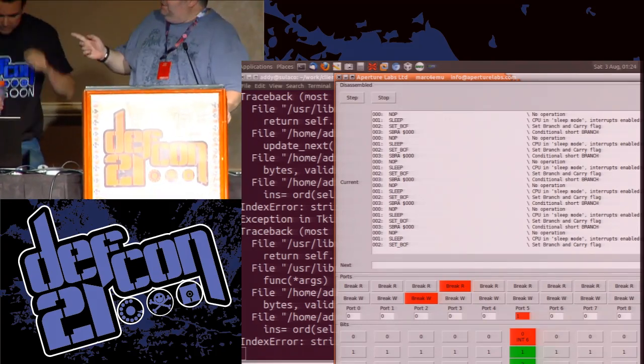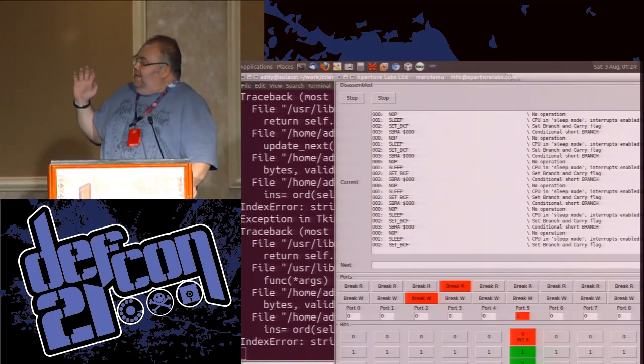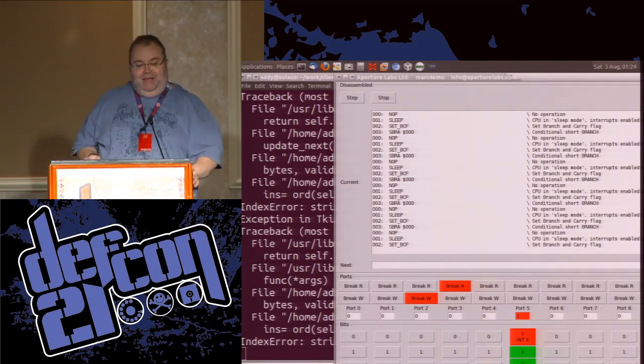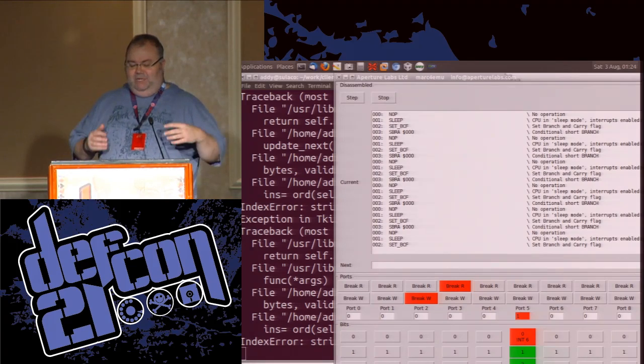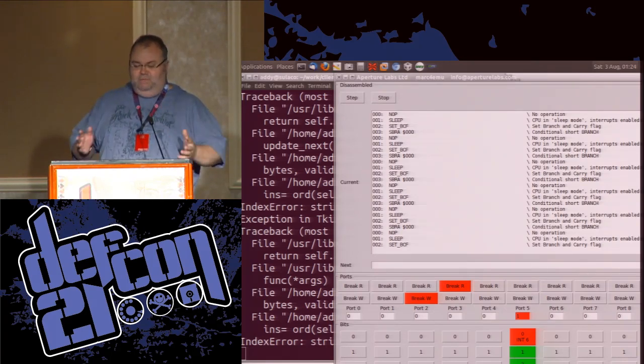Thank you. Sorry. So, just before we go to questions, one of the cool things about this was the manufacturer was so secure in their belief that no one was ever going to get the data off this chip. It's mask ROM. No one can read mask ROM. Once it gets its fuse blown, there's a diagnostic routine that allows them, once the chip's assembled, to verify the code, and then they blow a fuse and it's gone. So you couldn't possibly do it.